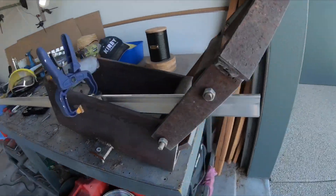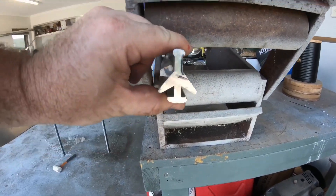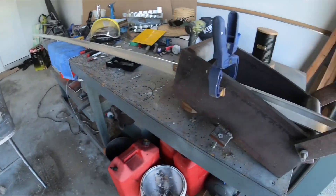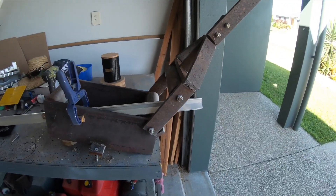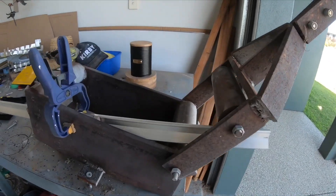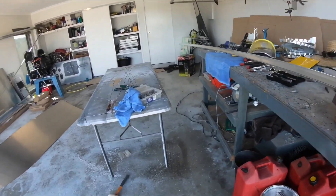I've got the keel over here, so I've got the keel material. The sheets go in here on both sides, and this keel sticks out so it's a nice solid keel. The challenge is you've got to get it to that curve. So I've got to bend little bits at a time, and I've just pulled out the old bender that I used to bend the cruiser nose forks — worked really well for that. It's just a big massive lever and I'll just pull down on this and do little bits at a time to get the shape.